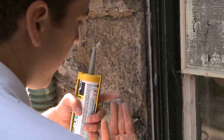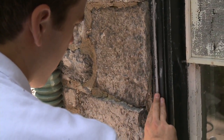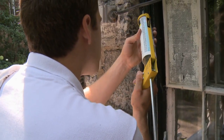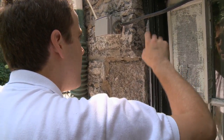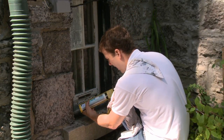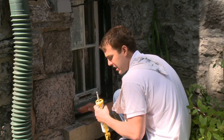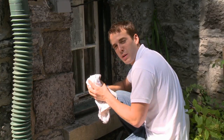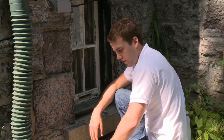A good technique is to guide the caulking with your middle finger and keep your other two fingers there to catch the excess. Go over it with your thumb after to smooth it out. Caulking is honestly one of those big things that makes the difference between a really professional job and an average one. On white or very light colored windows, if you look back at the end of the day, you'll see black lines appearing from the ground — that's just gaps between frames that weren't caulked properly. The best scraping and sanding job can really be ruined by an improper use of caulking equipment.